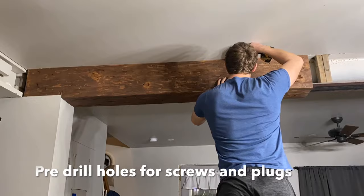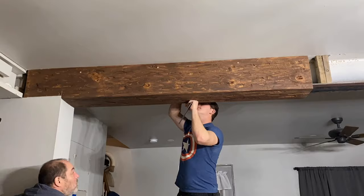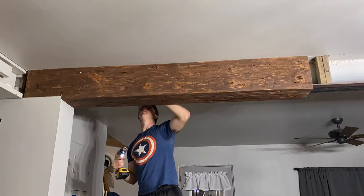I'm using a scrap 2x4 and a hammer to hit the beam all the way into place, because there's no way you're going to be able to push it if it's as tight as it should be. Then as I'm putting them up, I'm countersinking the screws down into the wood — first pre-drilling about three-eighths of an inch deep, then putting sheetrock screws into the 2x4s beneath the faux beam, making it a lot tighter to the ceiling.